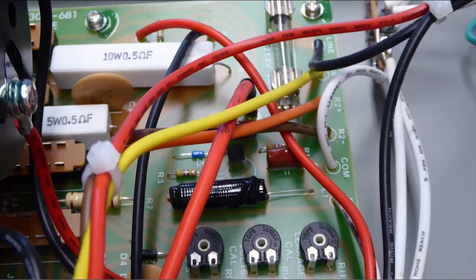The TO92 case, which is hard to see, is the Triac. And I was a bit surprised, even though it operates as a switch for great efficiency. I was expecting maybe a TO220 case. However, for me, I'm not going to be using the soldering iron feature. And also in the picture in the foreground, you can see the 3 calibration potentiometers that I found had a really nice range and were easy to adjust.